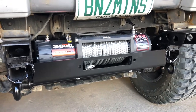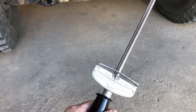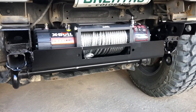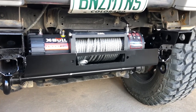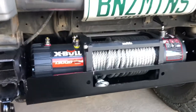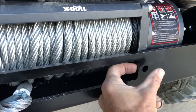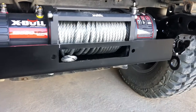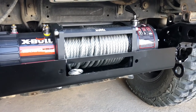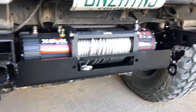I put all the bolts in, tightened them down, and torqued them to spec. My clicker torque wrench is out of commission so I'm using the old school torque wrench — but I'm replacing these bolts with heavier grade hardware anyway. Now mounting the roller fairlead. One issue: the size of the winch body gives me very little room up here. There's just enough room to fit a finger behind to put bolts through. If the bolt threads project past the end of the nut too far, they'll run into the winch, so I may need to add a spacer.